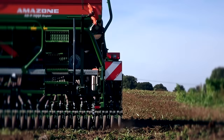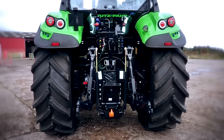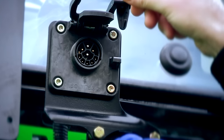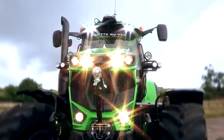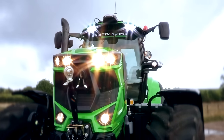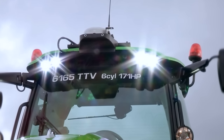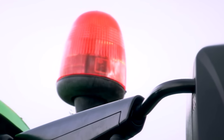Rear linkage capacity of up to 10 tonnes, coupled with up to 170 litres a minute hydraulic output at eco engine speed. We have a standard Power Beyond feature; as an option we have our ISO bus socket, and next to that we have our air braking couplings. We have new lighting groups: the neatly styled bonnet lights integrated into the front grille, the front linkage compliant headlights on top of the indicator stalks, and an LED light package. Above that we have the antenna for our Precision Farm system AgroSky. Twin flashing beacons are available both as standard or as LED.